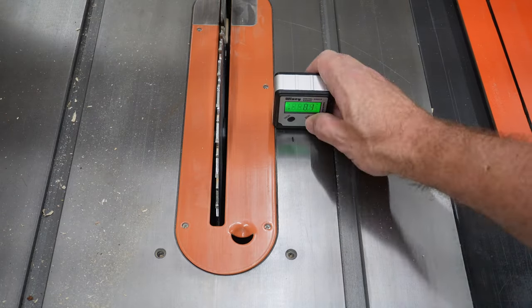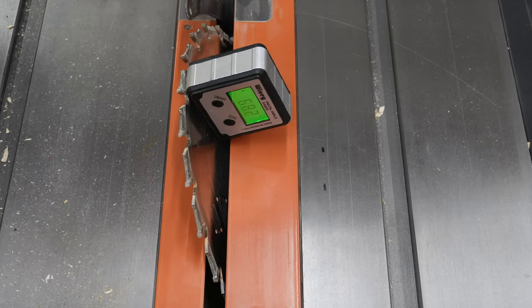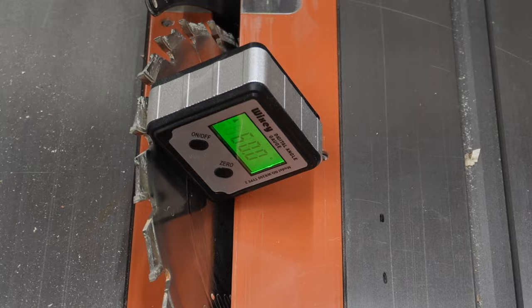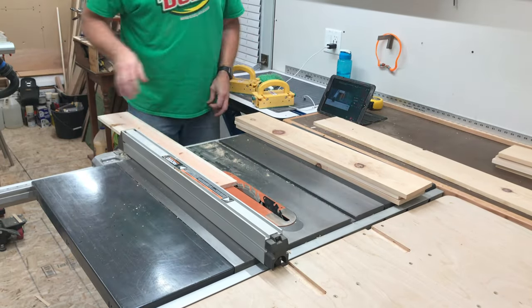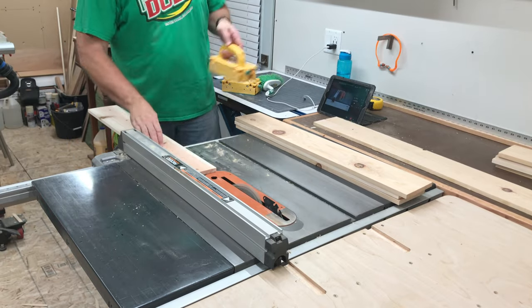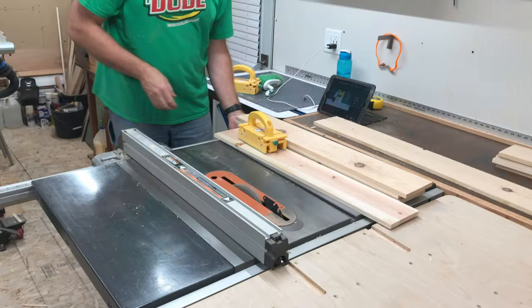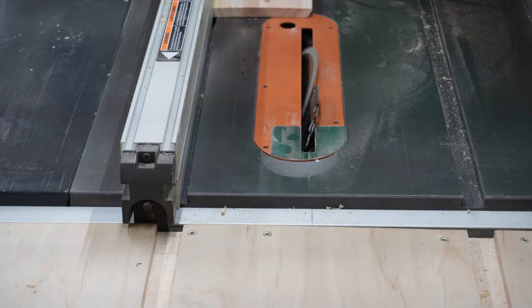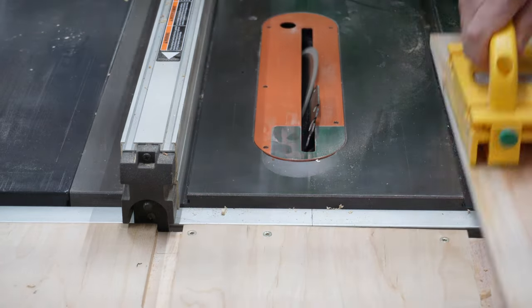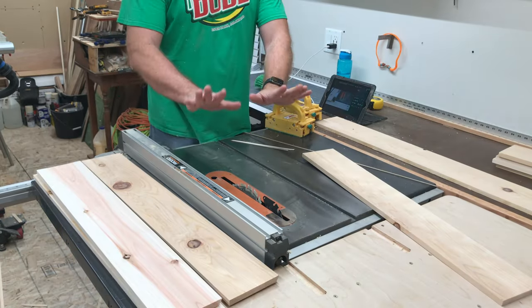Next, we're going to tilt the table saw blade to 30 degrees off of square, or 60 degrees from the table. With the show face up, you're going to trim off the bottom edge of your bottom boards to make a 30 degree bevel, leaving the whole 5 inches on the face. These are parts A1 and B1. When you're done with that, just leave the saw set up like it is. We'll be making another 30 degree bevel in a later step.